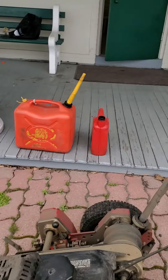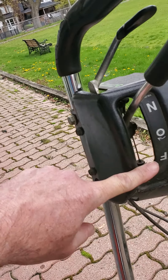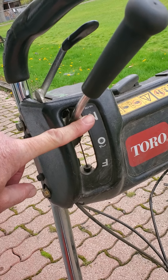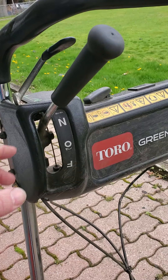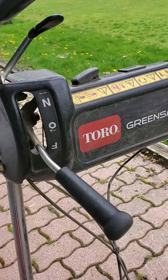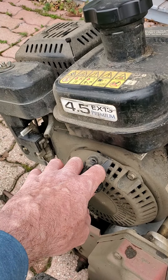I've got the stand up — always worth checking. I am on. Another thing you must know: this lever has the machine in neutral at the moment. There's forward and there's neutral. You definitely need it in neutral. In fact, if you had the handle down, the engine would not start — it's a safety device. You could be pulling away for hours wondering why the machine's not working. The engine won't actually ignite until you've got it in neutral for the engine to kick into place.